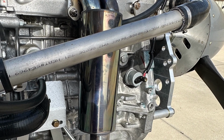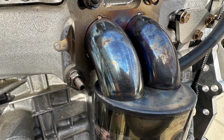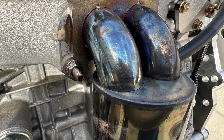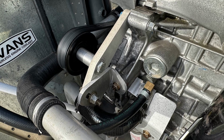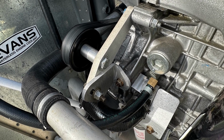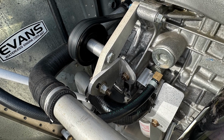Following the lightweight parts for the 130 engine, we now also have the lightweight muffler for the 150 engine. Big improvement to where we started. Not sure if any of the 150 engines now have the alternator on the exhaust side. That was changed very early, and the alternator should be on the pilot side or the intake side of the engine only.